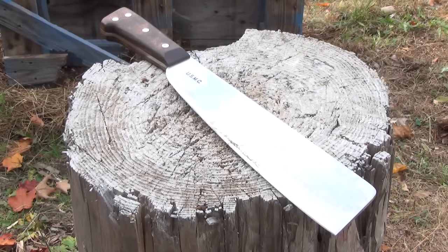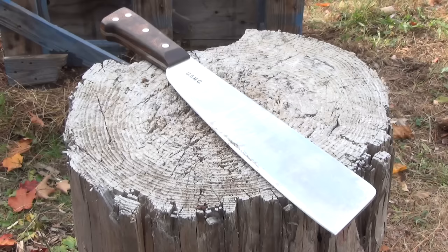There were some definite problems with this machete. The way this came with the factory edge — no way. The edge is way too broad, and it was also not that sharp. Sharpening is no problem, but a super broad edge requires reprofiling, that requires some grinding.